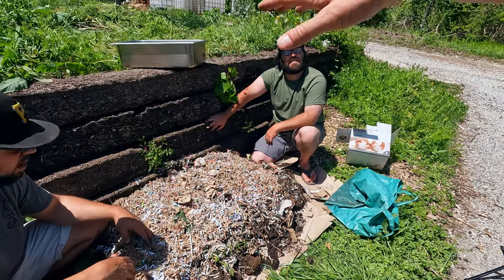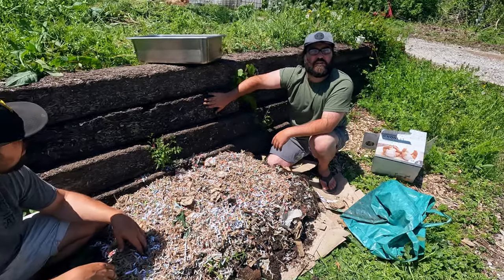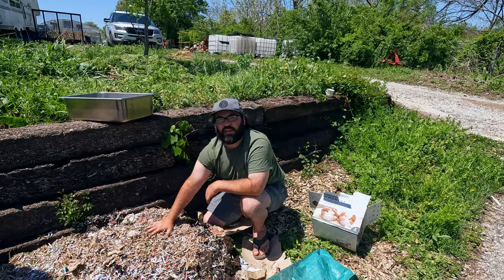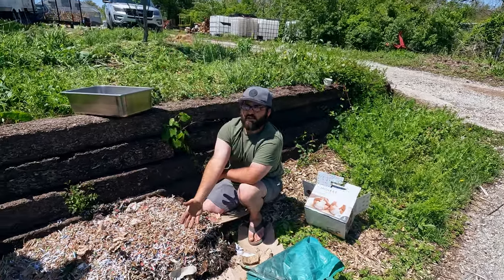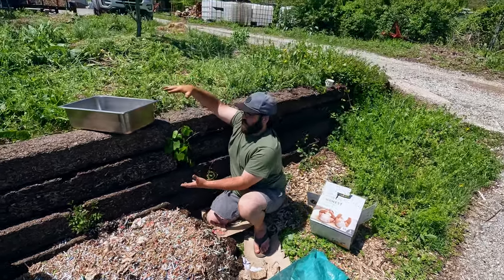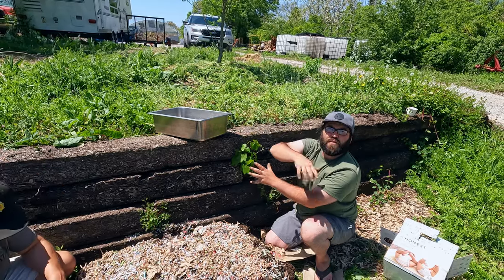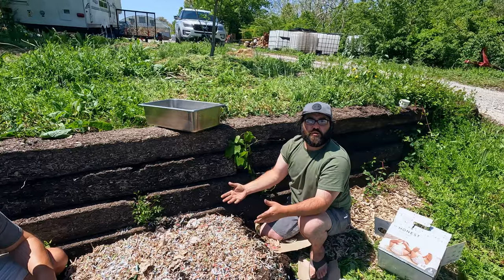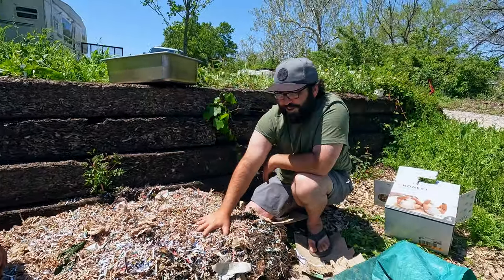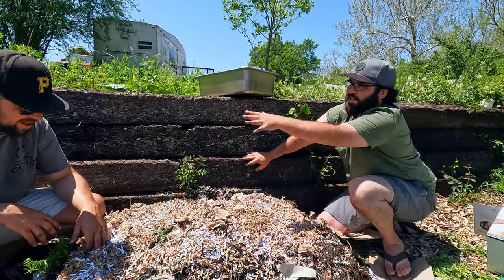By the way, this is not a railroad tie — it does not have any creosote. This is organic tree matter with a plant-based glue that's not toxic. Our bed is also facing east, so when the hottest sun comes they'll be in the shade. All the rain that comes from the parking lot up here goes through this bioswale, which is full of mulch and gravel. Flash floods come in, sink, and absorb into it instead of running off, then it slowly releases filtered water through here as a slow-release action.